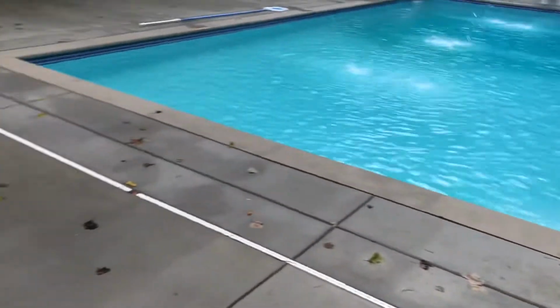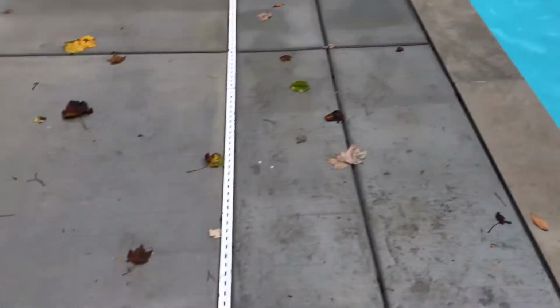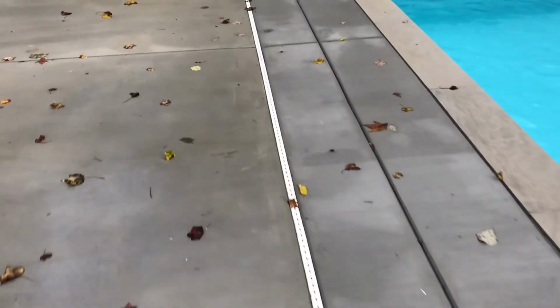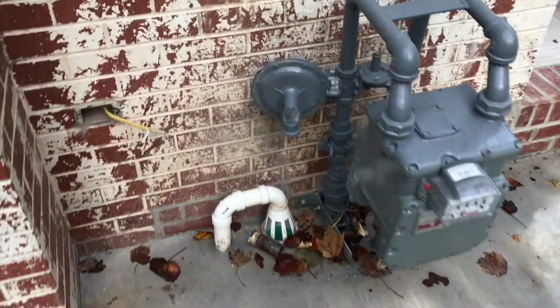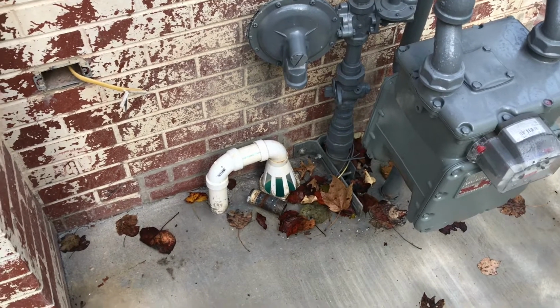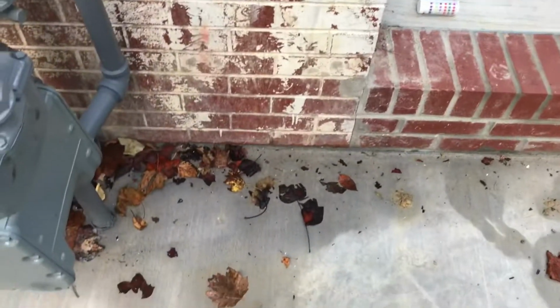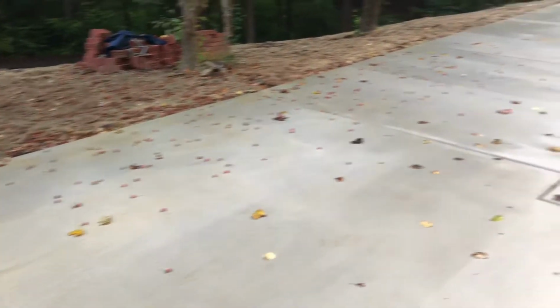on this side. This side we chose to put this little mini trough drain in here, and so that picks up any water that comes out of the pool and any water that falls in the form of rain over here next to the house, and drops it in over here. And this little trough drain has a drain pipe that goes from here over here to this drain line here. This is actually where our sump drain comes out from our crawl space. We got a dehumidifier down there, so there's a sump pump there, and it pumps out every once in a while. So the guys used a saddle tap underneath the concrete here and brought that little mini trough drain in. And then this side of the pool, everything goes toward the hillside and drains away.